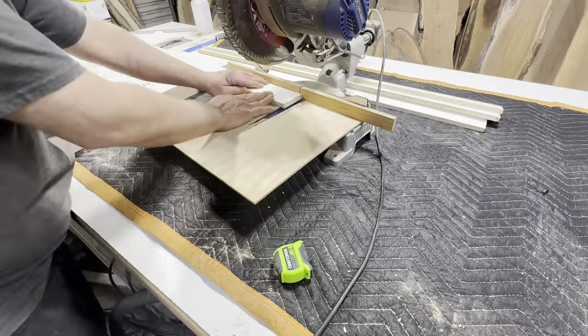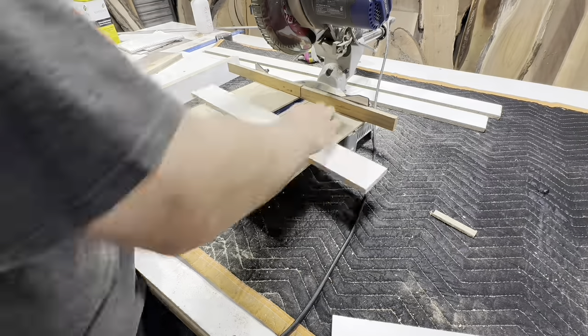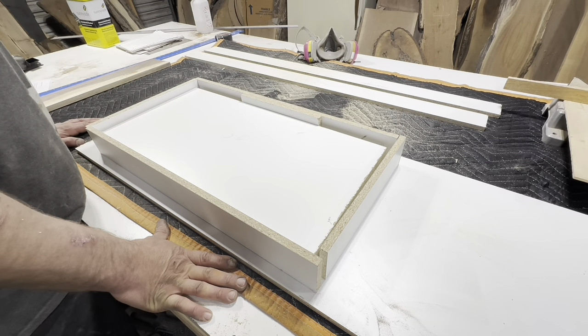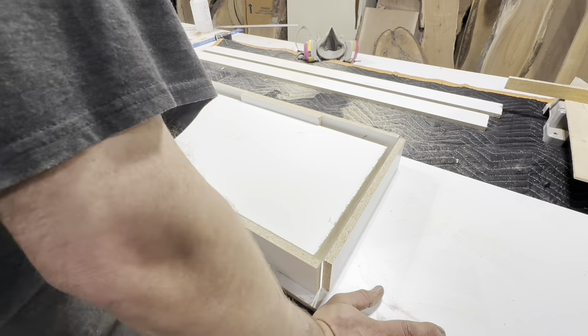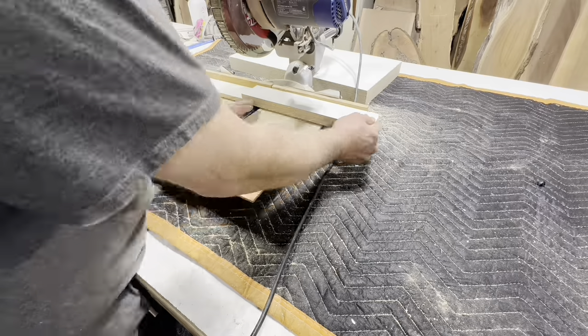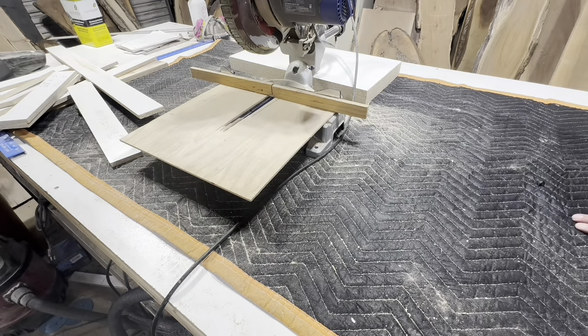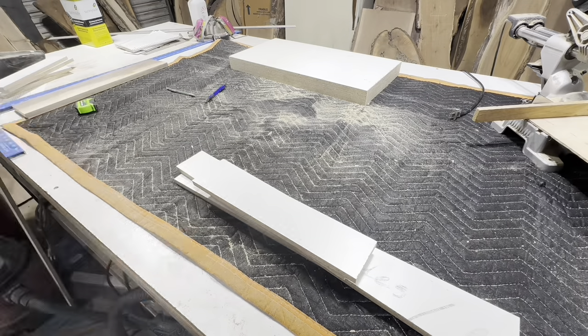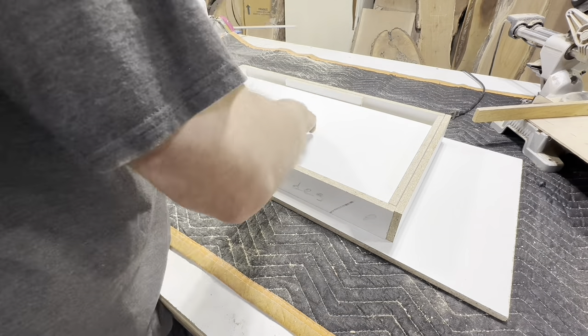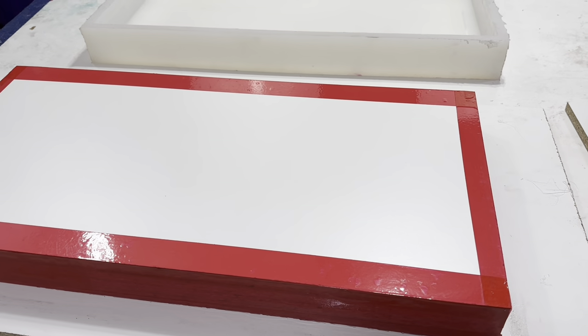Here I'm making the sides — I made these three inches wide so I had some room. When making the box I messed up: I should have made that one end 14 inches long. I forgot to add for the half-inch on each side. So make sure you're not like me — if you're going 13 inches wide you need to go 14 inches long; you have to add the extra inch. Then I'm putting pieces of half-inch in between to act as shims.